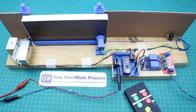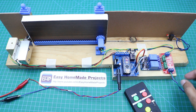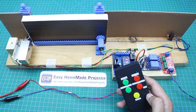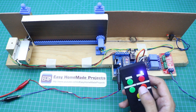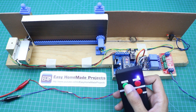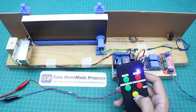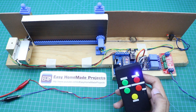After installing the Arduino codes, here is the final setup. The control circuit is connected to a 5 volt power supply, and the motor circuit to a 12 volt separate power supply. The remote control is USB powered so you can easily connect it to a USB socket in your car. There are 5 buttons on the remote: open and close buttons, auto open and auto close buttons, and a stop button. The open and close buttons only work while pressed and held, while auto open and auto close work with a single press, and the stop button can halt the gate at any position.